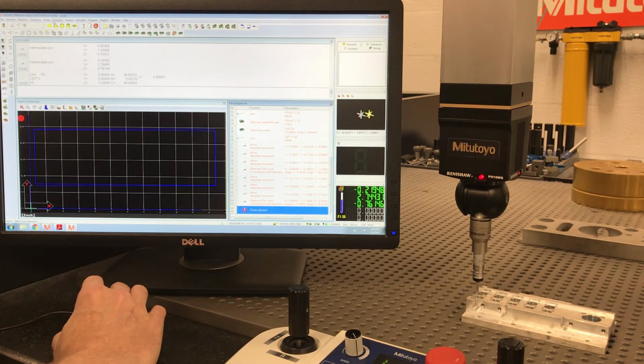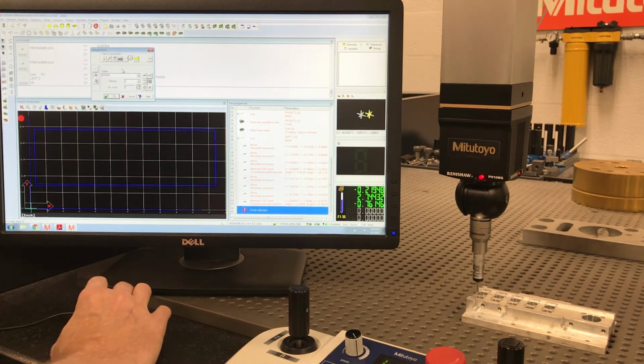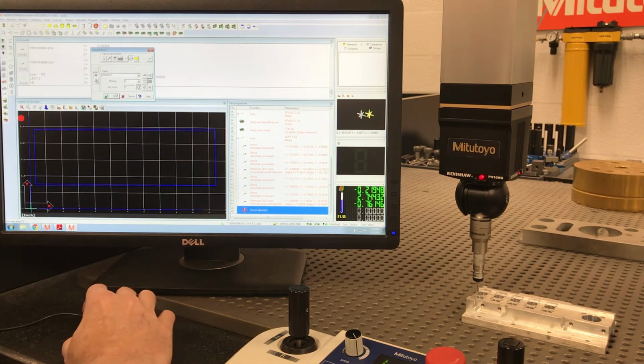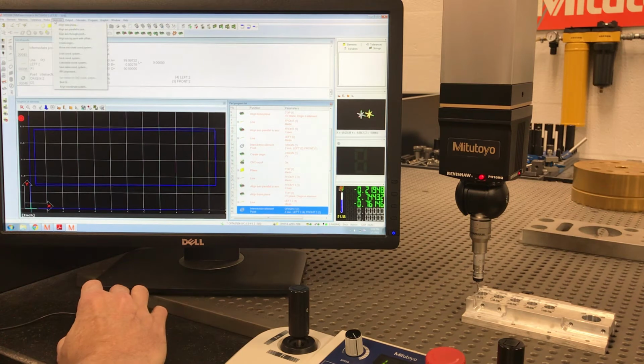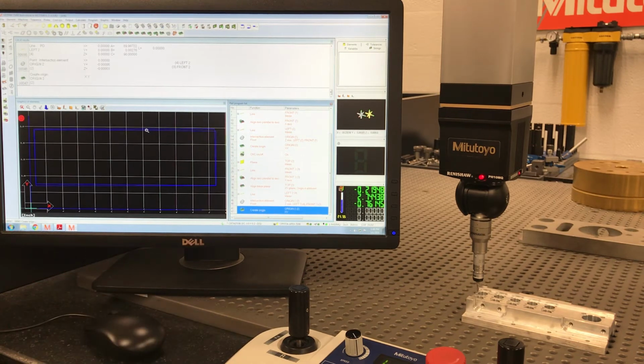All right. Now we create a point. It's recording. We're in CNC, so it's recording everything we're doing. Intersection, memory 2, so it's my, matter of fact, we could call it origin 2. Okay. Between the front 2 and the left 2. So this is our remeasure. I want to create my origin at origin 2. Okay, we have just realigned it with the machine.